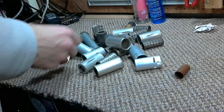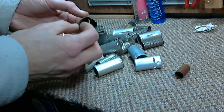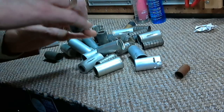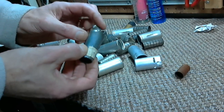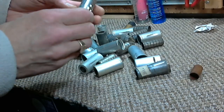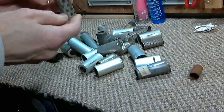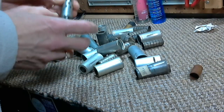Got quite a few here. Here's one that's very old. It's tapered. And also, these work best, not always, but usually when they are grounded. So they need to go down the tube and hit the chassis somehow and pick up a ground connection. That's what's going on with this flanged end here. Here's one that's got holes put through it. Conceivably, that's to improve the tube's cooling by letting some air come through. These things are generally fairly neutral on the tube temperature. Some people might think they cool them.